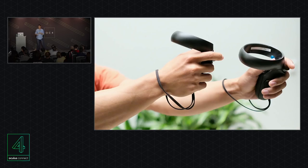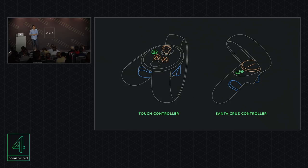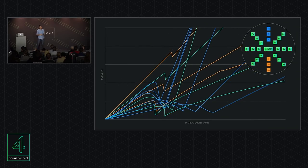Getting the controllers tracked is just the first step. There's the next question about what you can actually do with them. We're thinking through what controls and buttons to put on the Santa Cruz controllers. We've kept the Oculus and menu buttons, the trigger and the grip button. One experiment we're looking at is touchpads, which offer nice affordances for swiping, scaling, and manipulating objects. We want each of these elements to feel really great. Jeff on our team actually plots a force displacement curve for each touchpad — on the x-axis is displacement, how far you've depressed it, and on the y-axis is force, the resistance you feel back. We want the touchpad to feel great no matter where you press.